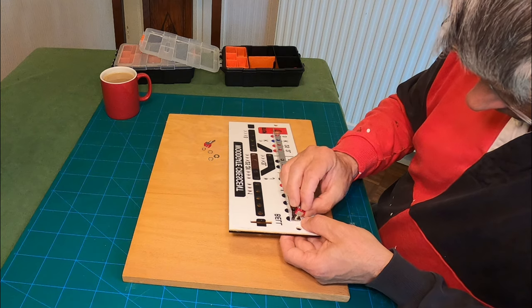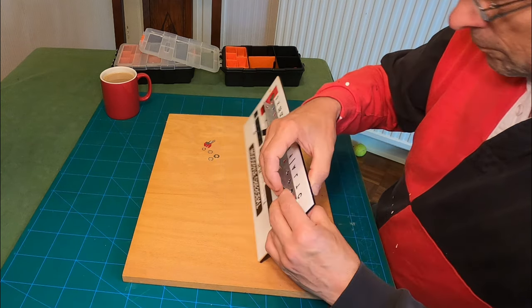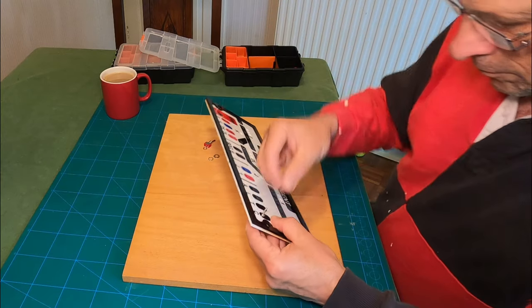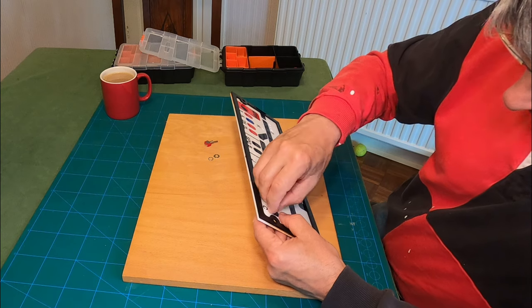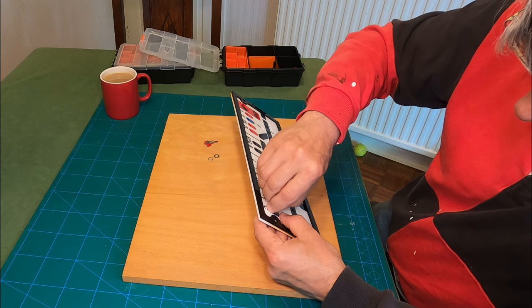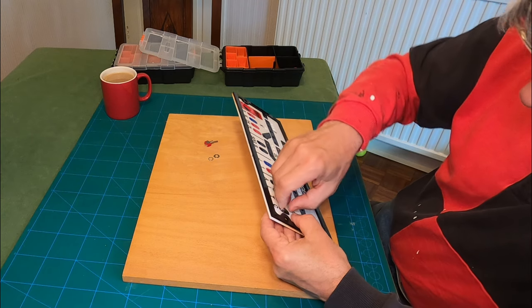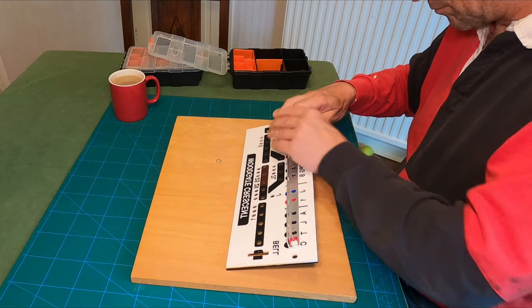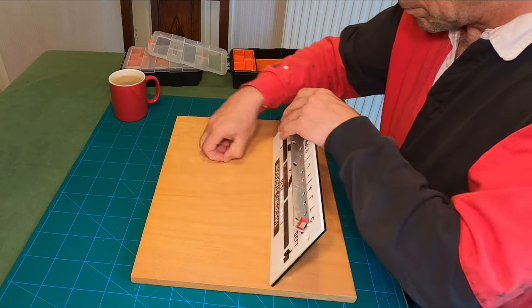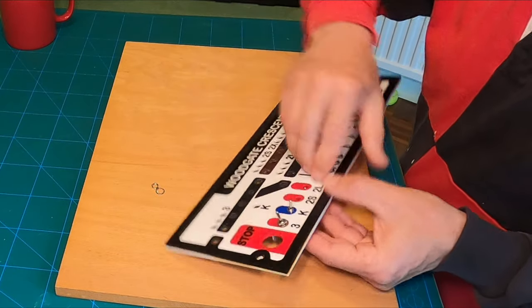The switches are standard toggle SPST switches and will be mounted in a line just below the track diagram. Many model railway mimic panels follow the more modern approach to panel layout with the switches laid out around the track diagram, but I've chosen to model the idea of using a row of control switches below the indicated track panel, like frame levers in an old signal box.